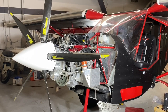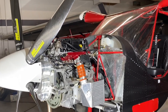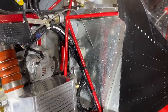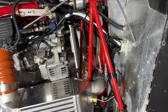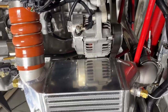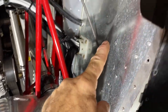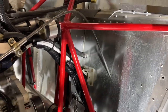We'll start with how to physically mount the engine to the airframe. Since this Super Duty has flown for almost three years, let's point out what's different with the engine mount. The first Super Duty mounts that went out have a square cage in the middle all the way around that holds the engine, with top tubes. Later mounts add a diagonal tube from the bottom up to the corner to give more room for the intercooler.